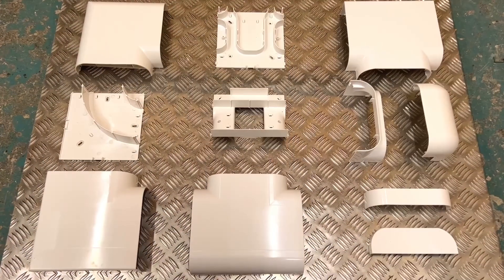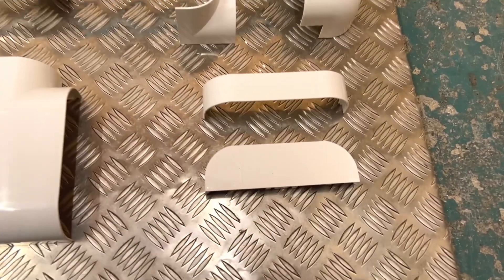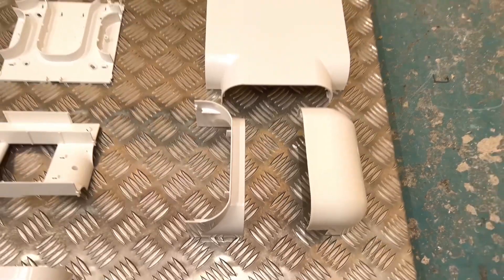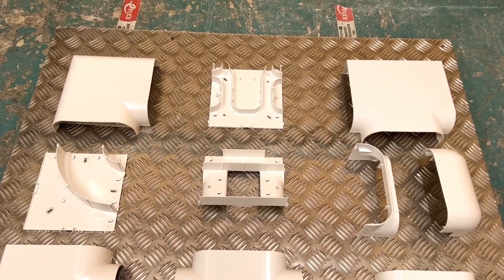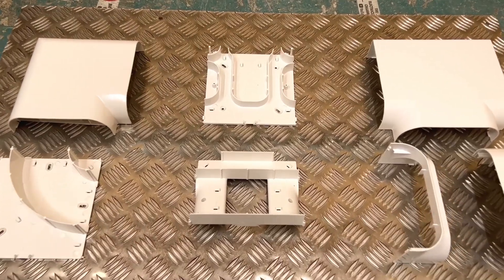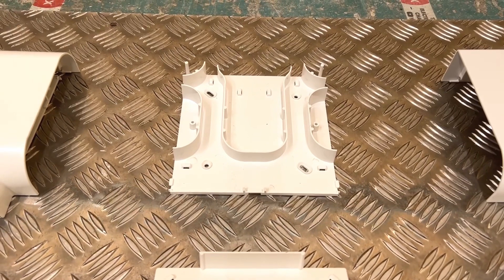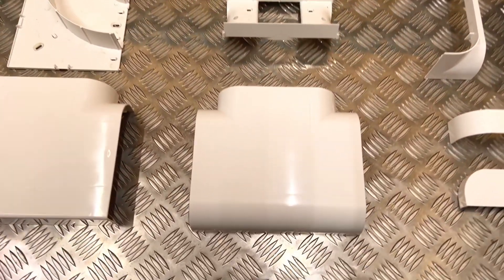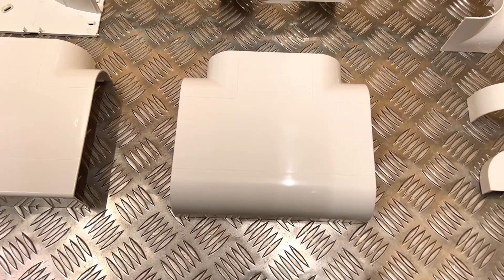You've got all the fittings you'd expect for joining together good quality trunking, including couplers, end caps, and internal and external bends for going around corners. There are also flat 90s and T's, and these come in a couple of different formats. You get them complete with bases that simply butt up to the trunking, and then the lid on the trunking goes on, and then the lid on the fitting slightly overlaps that to cover up the join and maintain the IP rating of the trunking.